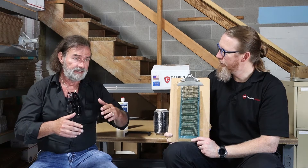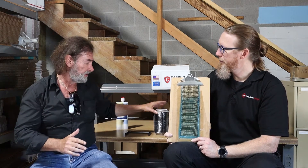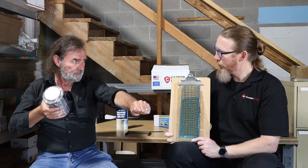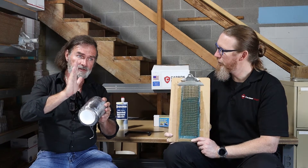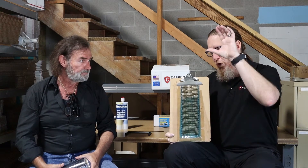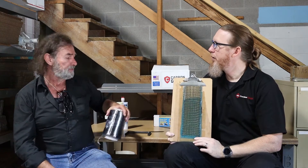The biggest thing somebody doing DIY carbon needs to understand is: make sure all your mortar joints and cracks are flat. We want them to be flat, because carbon fiber needs to be pulled tight like a rope. So if we're running this along the wall and we dip inward into a mortar joint, you've lost all your strength. If you've got a mortar joint where you're going to put it, you want to fill that in with a high-compression material.